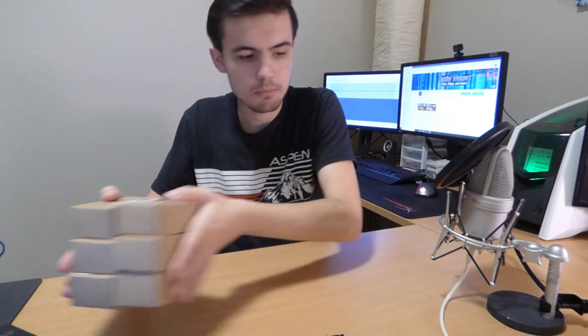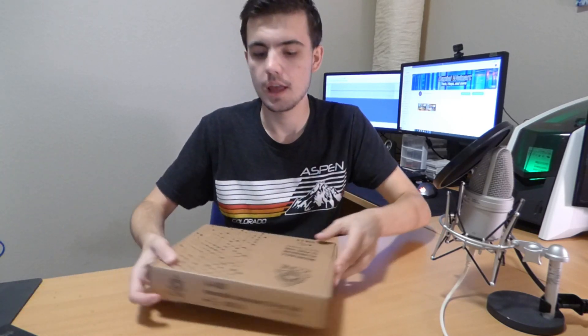My final thing is the USB hub. This was a little difficult to figure out which one to buy, because you can't just use any regular USB hub — you need one that can deliver high energy output to each port. These miners need quite a bit of USB power to run well. It's recommended to have at least 2.5 amps on the USB port for it to mine at good high capacity. The more electricity you give it, the higher it can mine, but it can also overheat.